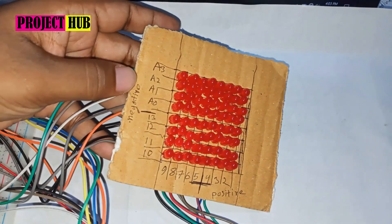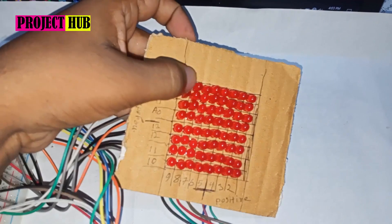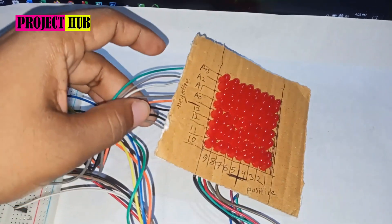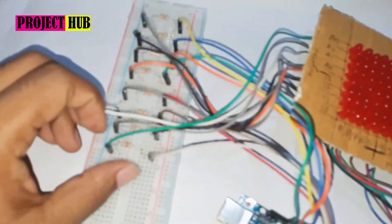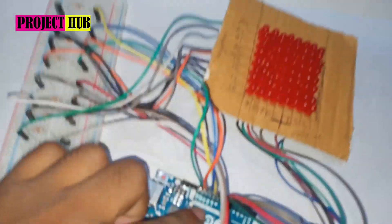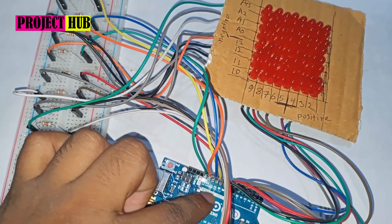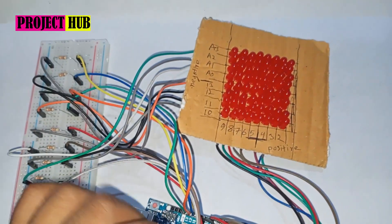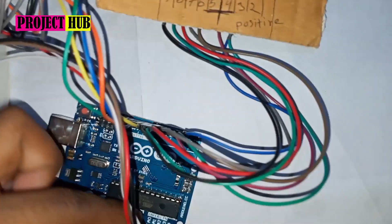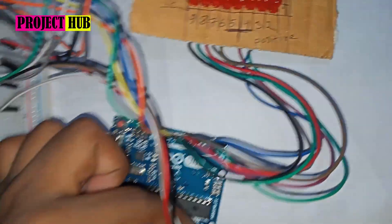As you can see, in an 8x8 LED matrix we have 16 different wires — 8 are positive and 8 are negative. These are the negative rows and these are the positive columns. I connect the negative wires through a 1 kilo ohm resistance to the Arduino board. Now, the Arduino board has 14 different digital pins, but we need to control 16 wires for this project, so I use the analog pins as digital output pins.